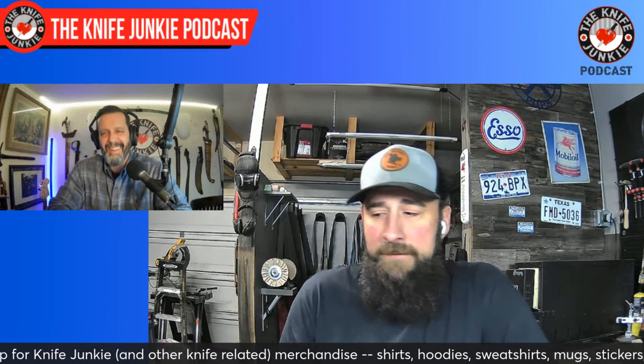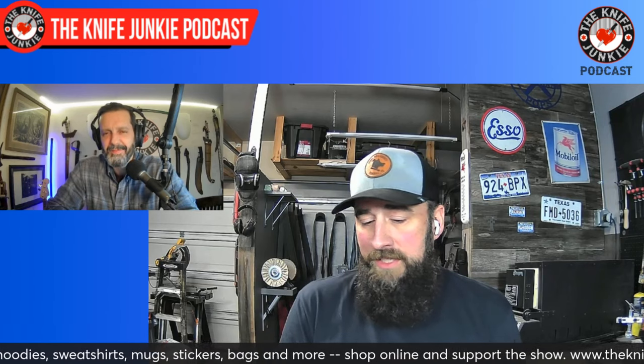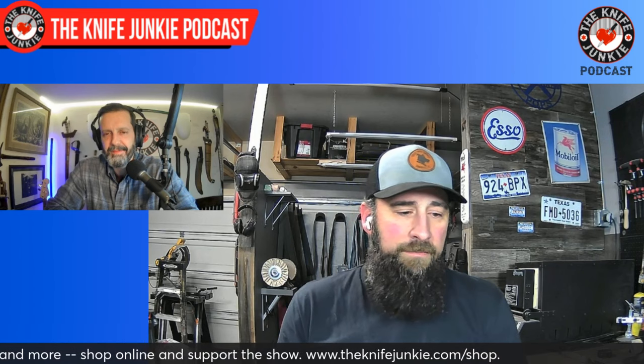It takes being able to slow it down — you need a VFD. Some of the equipment really helped. Learning to use fresh belts all the time — I think it was Jason Knight who said, use belts like you own the belt manufacturing company. Easy for him to say — he's probably sponsored by somebody, but the idea is using fresh belts and really just pushing yourself. Can I get that thinner? Yes, you can. The first time I got a knife down to pretty much a zero edge, I realized how much more time, effort, and patience it took to get there, but ultimately it was going to make a better knife.